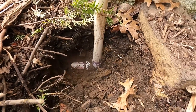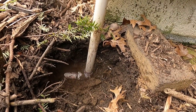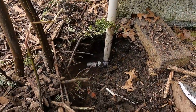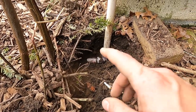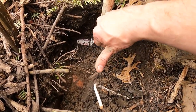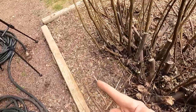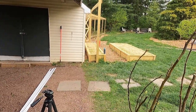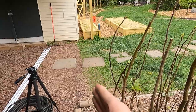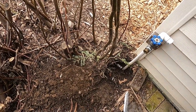As you can see here, there's a very clear 90 going this way. The pipe comes down, hits this 90, and goes left — and then it probably takes another 90 and runs toward the water supply on the left side of the greenhouse. What we care about is identifying where this was going. We're going to cut right here, put a T in, and then send a new pipe coming this way. That's the spigot — we're running our pipe right between the raised bed and the shed, which sends us right into the corner where our chicken water will be. I've got a lot of trenching to do. I'll speed it up for you guys so you don't have to sit through the whole thing.